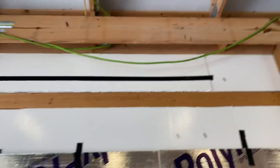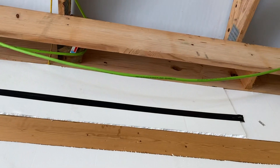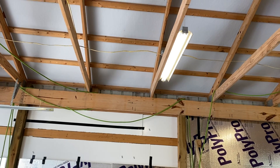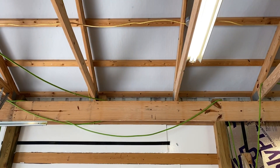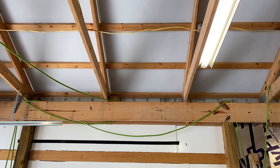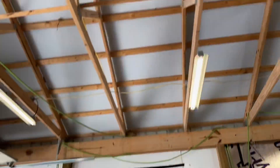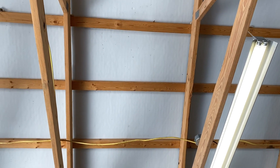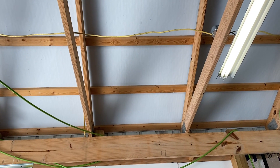To the top of the wall, if you go in between there it's 12 feet — so you've got an eight-foot and a four-foot section on the side. You just notch around the wood up here, and as you can see up at the top that's going to leave about an eight-inch area that I'll have to come back and fill in. I'll probably put spray foam in the ridges of the metal on the outside of the building to keep air from getting in there. On top of the ceiling under the tin there's already an inch and a half foam, then I'm going to leave an inch and a half gap and then sheet on top — so I'll have an inch and a half of foam, the inch and a half gap for the wood, and then another inch and a half layer.